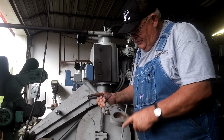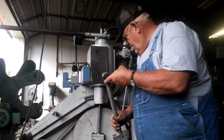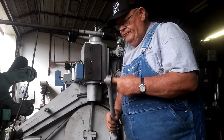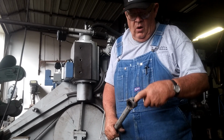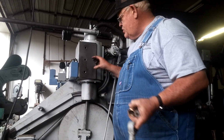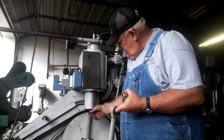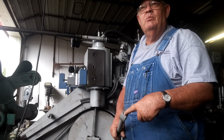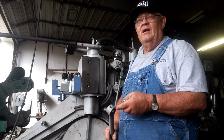Some of the early models had a key in it where you couldn't assemble it wrong. Now, I think they're marked, so you just put the numbers to the numbers. This is an early model that had a needle bearing, has a hole here. The oil that's scraped off of the inside of the cylinder wall by the rings is up in this area and gets into this to lubricate it. Sometimes it's insufficient and this bearing could go bad.